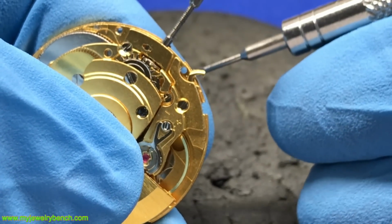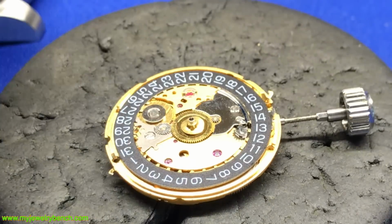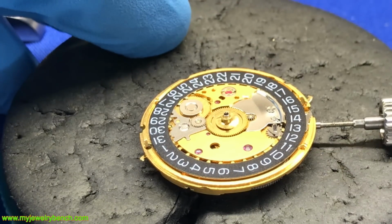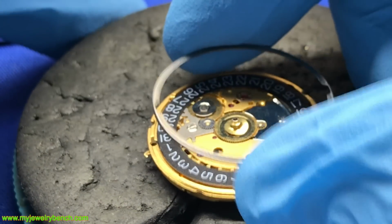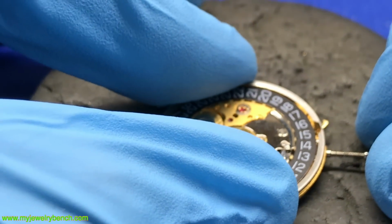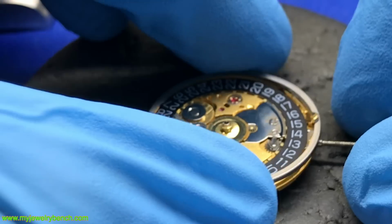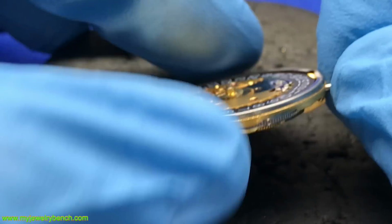So you're going to pull those tabs out, those little rings, and you're going to make sure that your dial fits the watch movement. It should if you ordered the correct dial, or you may have to cut certain feet off, if you have optional extended feet, or you might have like 4, 5, 6 different dial feet on your dial. Just cut off the ones you don't need, and then gently seat the spacer ring on before you do that. There are 2 little holes where the dial feet will go through and clamp onto those 2 little locking tabs that we pulled out. You're going to make sure that that dial spacer fits onto the watch movement correctly and allows you to poke the dial feet through those holes and then lock them into place.